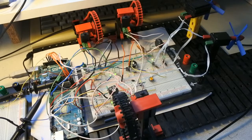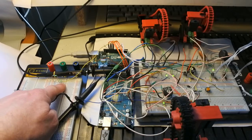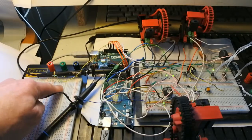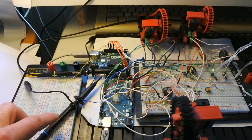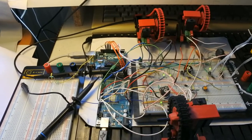So, I2C printing just one thing, but I needed to control this LED. For that I focus on the Uno with a wire that I put in last time on port 3. Fortunately that works. Now I have also put two probes here for the data and the clock. So with the oscilloscope also on camera, let's see how things work out. And I'm very curious if I get everything working the way I like.